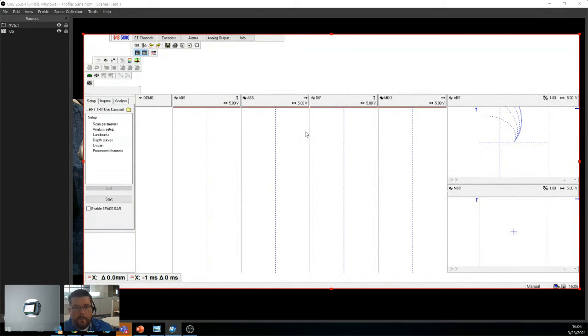Okay. I'm using a bobbin probe, which you saw on screen is plugged into the 4-pin, and I'll be using an internal reference. So that's fine. Now the wizard's saying, knowing what you just told me about the F90, these are the other 3 frequencies I recommend. F180 is basically F90 times 2, so 174 kilohertz here, F90 divided by 2, 41, and then F90 divided by 10, about 8.